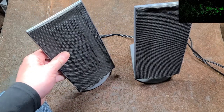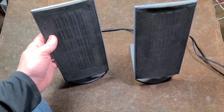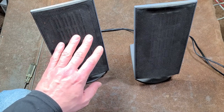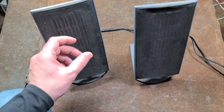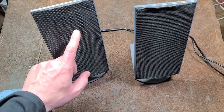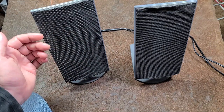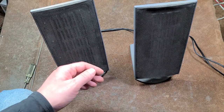What gives them a real distinct sound quality advantage is that even though they're inefficient, most of that is because you need a high voltage potential to get the drivers moving. On the other hand, the entire weight of the film sheet in this 4x8 speaker is probably less than the dome of a one-inch dome tweeter alone. They are phenomenally lightweight, don't generate back voltage, and that super light weight means they have a super quick response — mid-range and treble coming out of these is excellent.